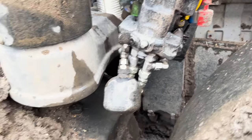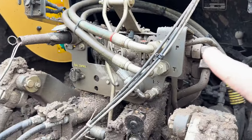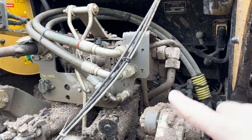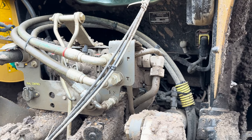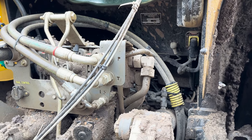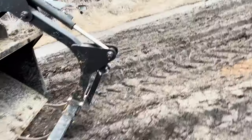Walking to the rear of the tractor — here you can see P for pressure, T for return or tank, and LS for load sense. Those three ports are built right into this tractor, which is really nice. Some tractors need a power beyond block to tap into these. The pressure supplies oil to the valve, the tank returns oil from the valve, and the load sense is the small amount of oil activating the valve.